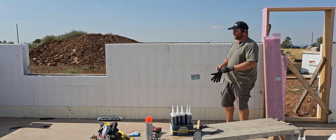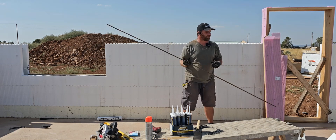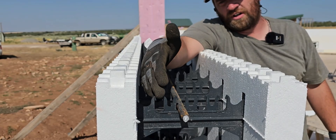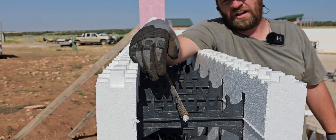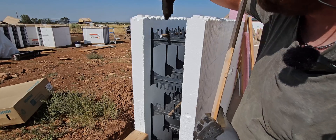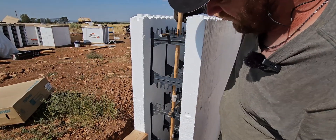The walls are coming up pretty high right now — a good framer could probably frame these exterior walls just as fast as I'm doing this. I cut these pieces of rebar; there's a window there, there's a door here, so I couldn't fit a 20-foot stick all the way between them, so I cut it to length and set it down in this channel. On the bottom courses I put one on the outside and inside, but on these courses going up I'm only putting one stick of rebar per level, alternating back and forth. Because these are spaced apart, I can actually fit a vertical piece of rebar between them all the way up — it'll just sit there and can't really go many places.